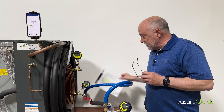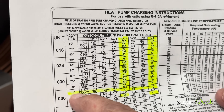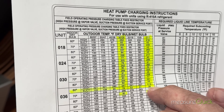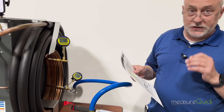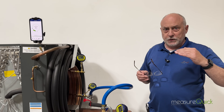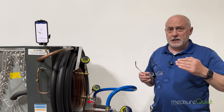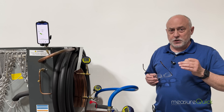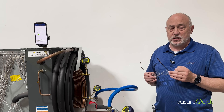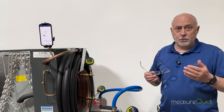If you take a look at this heat pump heating chart, you can see we've got a three-ton heat pump system. At 60 degrees indoor dry bulb and zero degree outdoor dry bulb, we're at about 38 PSI suction — meaning we're about 10 degrees below zero on the outdoor heat pump coil. In order for heat to travel from outdoors at zero degrees into the coil, the coil has to be physically colder — about 10 degrees below zero. That's also a 10-degree dew point temperature, so if we have any moisture in that system and it falls below negative 10 degrees, it's going to turn to ice and freeze in the outdoor metering device, and the heat pump will be done.